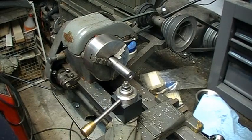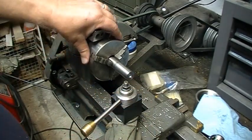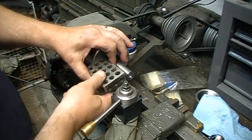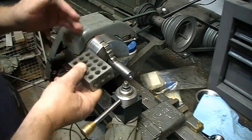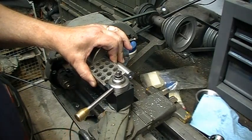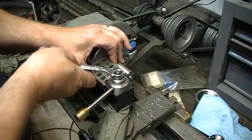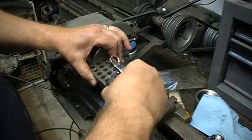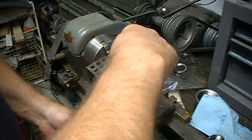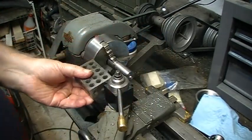In order to line up the drill chuck and my quick change tool post, the first thing I'm going to do is square up the tool post with the chuck. I'll use a 1-2-3 block and bring my tool post in, snug it up against the chuck, and tighten it. Now my tool post is nice and square to the chuck.